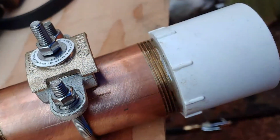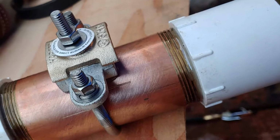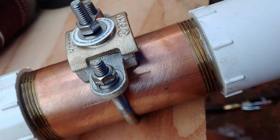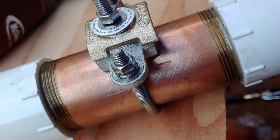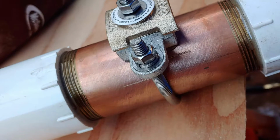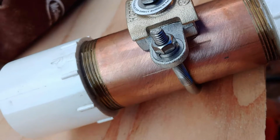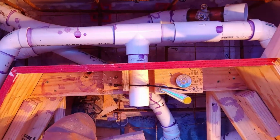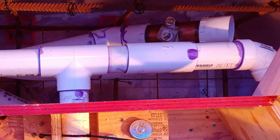On the recirculation line, we installed this, which is a bonding pipe. During the research, we found that it's typical to bond the water itself of a pool to a hot tub. This is commonly done through the large underwater light niches or the railings for the stairs. But because we're using all plastic LED lights, we need another way to bond the water. This is a bronze pipe that's epoxied to PVC couplings and has a stainless steel grounding clamp. This will be linked with the bonding wire, which also ties into the rebar grid that surrounds the hot tub.